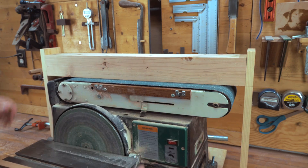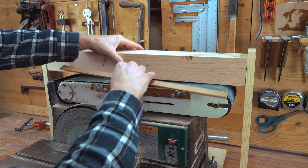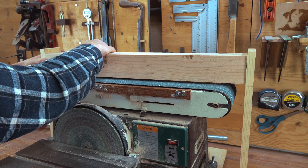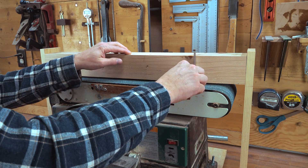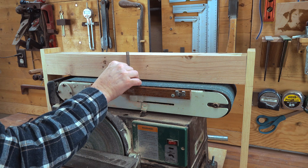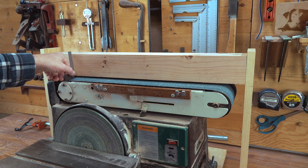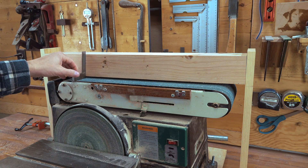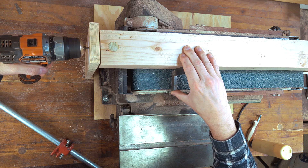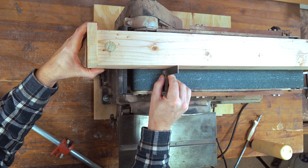I need to add a spacer because I don't want this to sit right on the belt, so I've got a thin strip here that's three-sixteenths of an inch. I'm just going to put that in the center. The most important thing here, of course, is to make sure that it's square. If we don't have a 90-degree angle here then we've failed to do what we set out to do. You'll also want to make sure that you're on the bed and not on the wheel on the end. Once I've got this in place, I'll go ahead and drill into the other one.